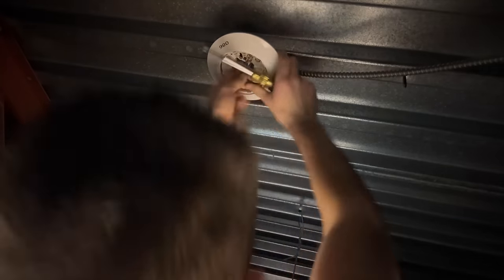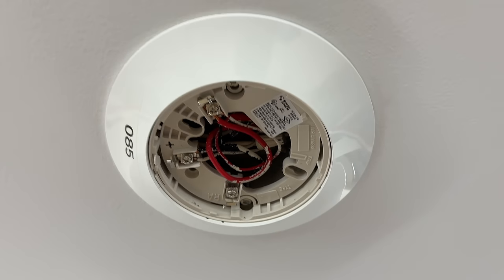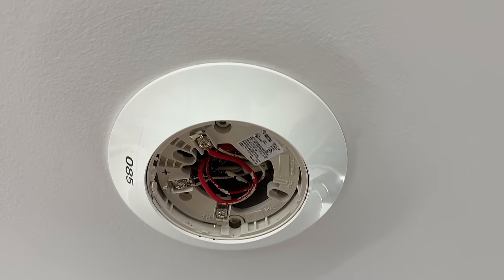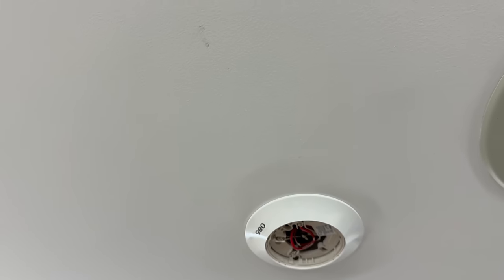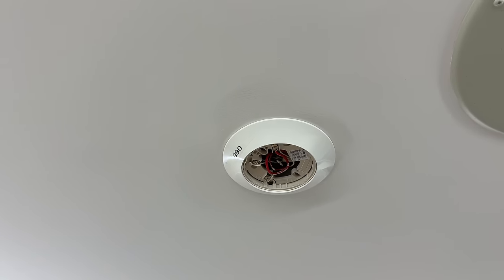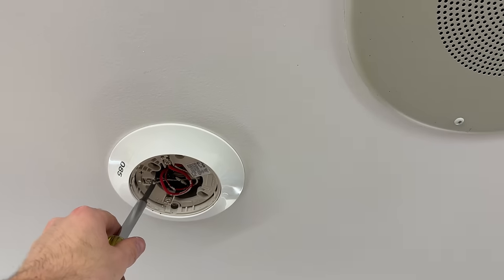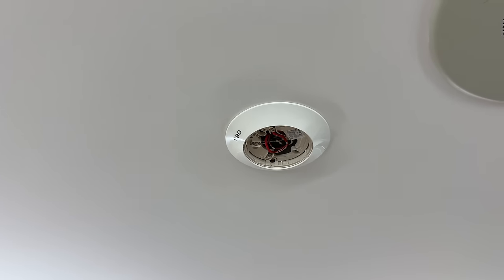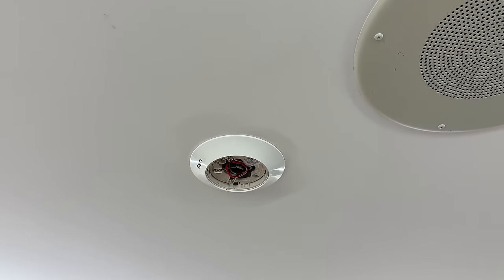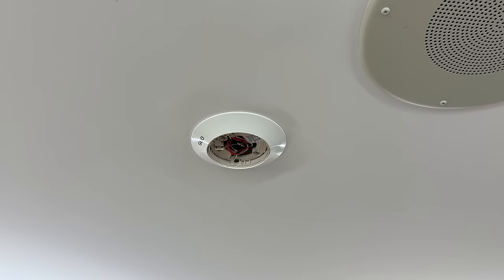So if you notice something looks like it's being installed wrong, it is actually done right. I have to meter every single device to ensure polarity, and mistakes were still made. You can see I've got blacks on positive and reds on negative, which should be wrong — and this section should have been straightened out, but nope, this is still the right way. So blacks are positive. Colors are completely screwed up. I thought we had it figured out when we switched it around, but apparently that's just the hallway — these rooms are still screwed up.